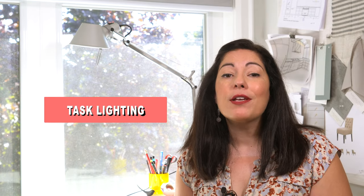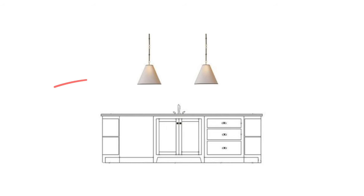Let's talk about what you need to keep in mind when selecting your kitchen island pendants. Typically you have lighting at the ceiling, like recessed pot lights, that provide general illumination for the kitchen. But you need to bring additional lighting down and focus that spread of light onto your island surface, and evenly distribute that light across the total length of your island — which means math. The first number to keep in mind is the distance between the underside of the light fixture and the top of your kitchen island surface. That space in between is key to making sure you have a visual connection between your island and the pendant light fixture above.